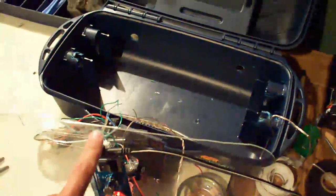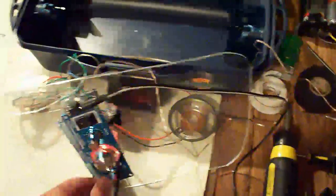Here's what it looks like mostly put together. I'll plug it in and show you how it works. I also have the lights on a switch, got my external power plug, and the whole control panel is built into the plexiglass. I'm going to glue in the lights and the speakers and fill the bottom area up. When soldering together the entire bottom area it is important to check every time to make sure your connections are good and everything is working — and as you can see, it is. So I'm going to glue it all into place and add the mineral oil.